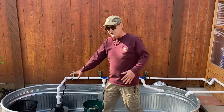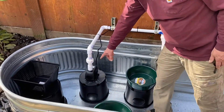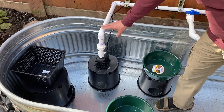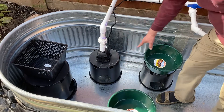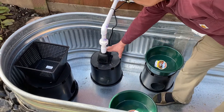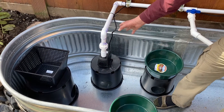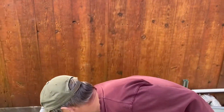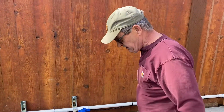The way it's plumbed in, we have a 1,200-gallon-an-hour pump — it's a Little Giant pump. It's sitting on top of a place where fish can hide. It's always important to keep your pump maybe mid-level in the pond because it keeps all the debris off the pump. Also, if something goes wrong and your pump wants to pump the whole thing dry, it'll only go that deep and then you won't kill your fish. And that happens — trust me.